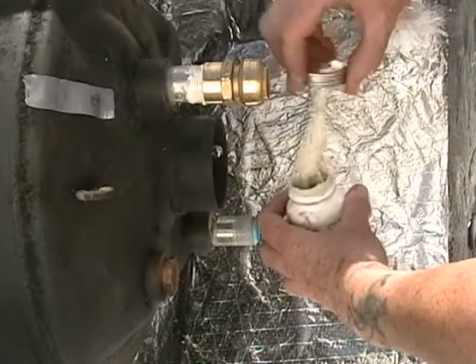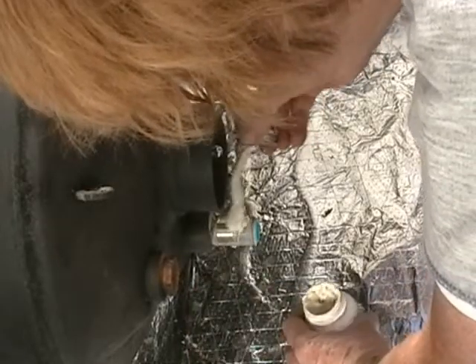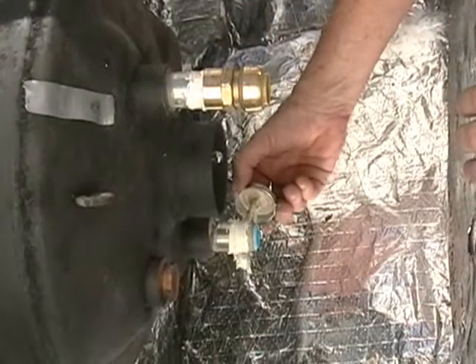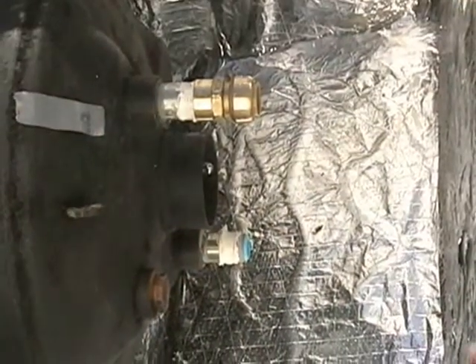I know I've said this before, but you avoid the first two threads on your pipe because you can screw that pipe dope down into your system. It can pass your dielectric union and get into your system, and that wouldn't be good with water or gas. This hot water is going to be going not only to the shower, but to your kitchen sink to do your dishes — I'm not sure how edible pipe dope is. Okay, that's nice and goopy.